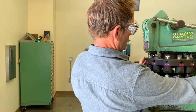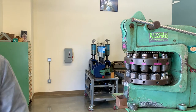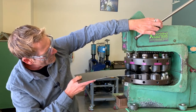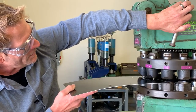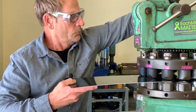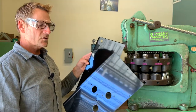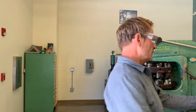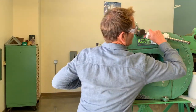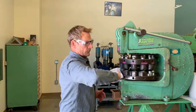Now I've made the three holes for the LEDs. For our on/off switch, that calls for three-quarters of an inch diameter, so I'm going to release and rotate the turret to the three-quarter inch diameter position. I'll bring the handle down slightly so the center point aligns with the center mark at the crosshair and feel it fall into place before completing the punching operation. I've now completed all the holes for the top and bottom of my prism chassis pieces. I'll again use alcohol and wipe to disinfect the equipment for the next person.